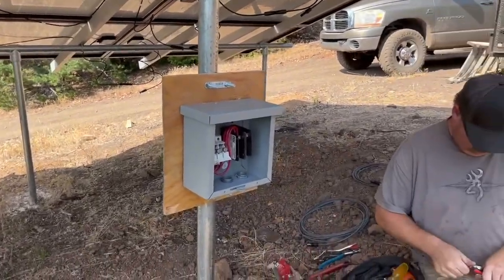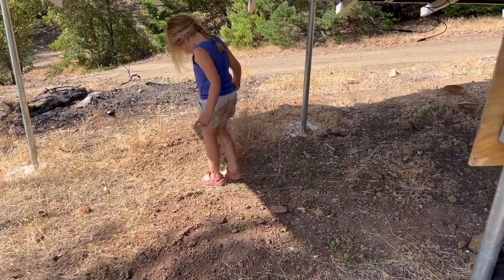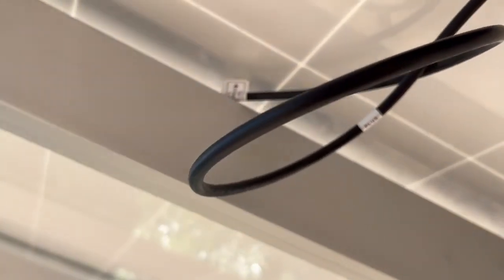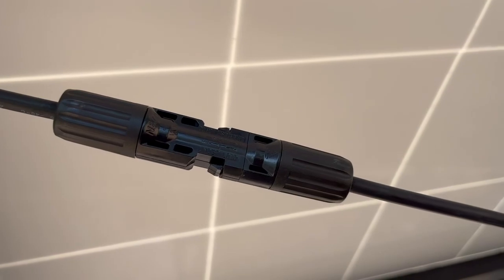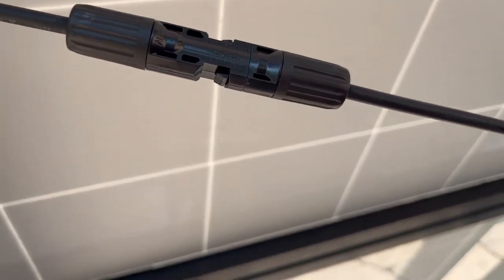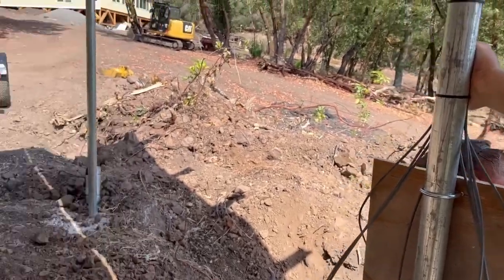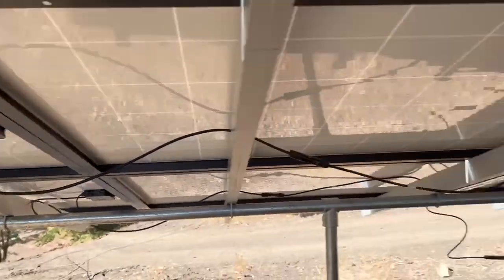That's our task for right now. Clara is eliminating the manzanita bushes from under our solar panels. We ran the wires through the rail here just to keep it clean and out of sight, but left them long enough so we can access the plug easily by pulling it out and disconnecting it. These plugs are really cool — plug and play, and unplug when necessary. It's just like a child's seatbelt strap. On the negative side we also have open negatives there, and we are not plugging those in yet because William is working in the combiner box — we do not want to complete any circuits.